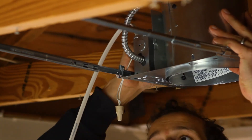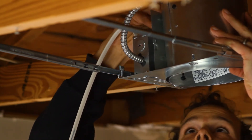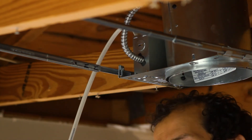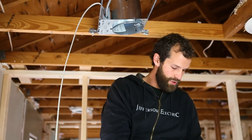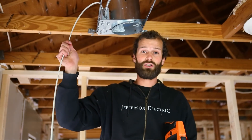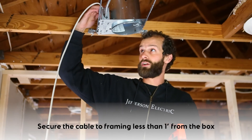I'm going to fold each set of conductors into the recessed junction box housing, tuck it in there carefully, take the cover and put it in a safe place, and secure it to the box. Then I'm using a Klein stapler to secure the 14-2 Romex within 12 inches along the length of the cable to framing from the point of entry.